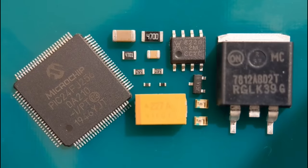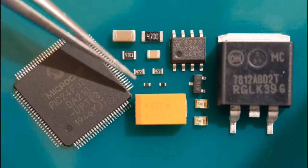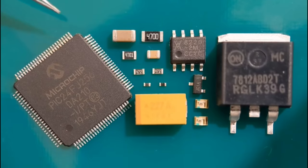Welcome to this short guide on fitting the basics of surface mount devices. I'm going to go through 1206 capacitors and resistors, 0805, 0603, right down to 0402s, then fit an SO8 IC, a voltage regulator, an SOT-23, a couple of LEDs, and finish with a 100-pin quad flat pack. You'll need a couple of fine tweezers and different sizes of solder, which I'll mention.